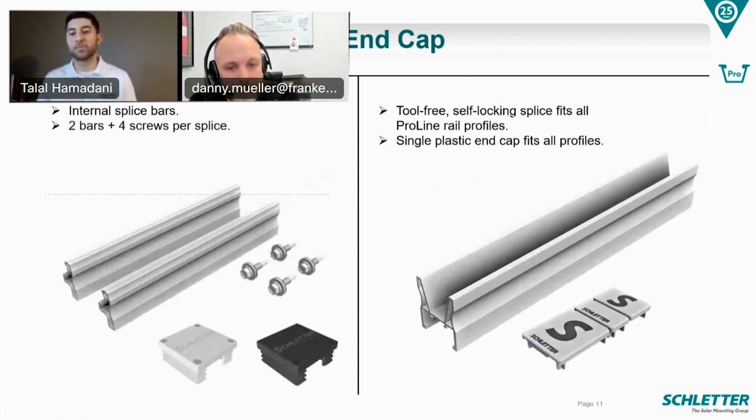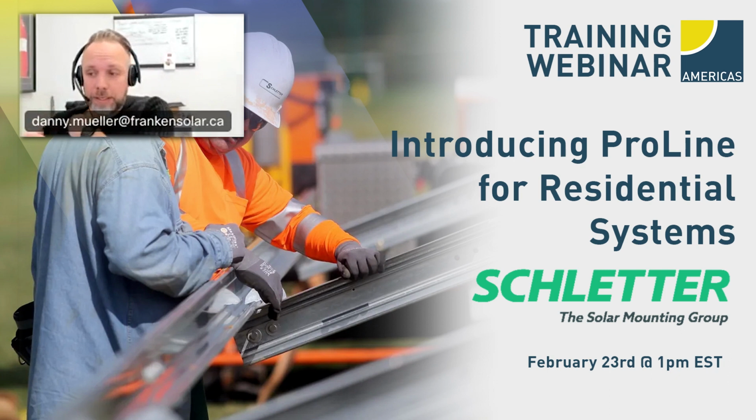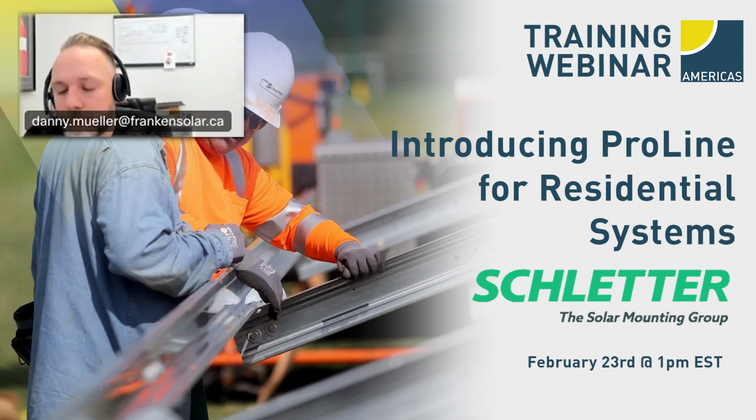So to continue on about the splices, with a side-by-side comparison on the new Pro Connector splice on the right and the old Solo splice bars on the left. Yeah, so about that, we're pretty excited about the splice, as Talal was saying, as it is just one component. It allows us to go shorter rails, and you can then on the site turn it into a longer rail. It will be a zero gap splice, meaning that you can connect them and it will literally be like one rail.